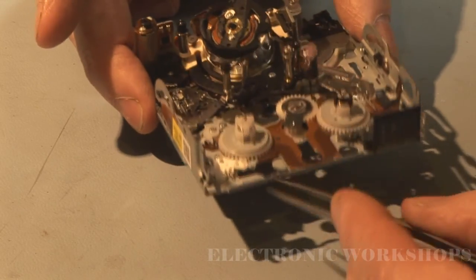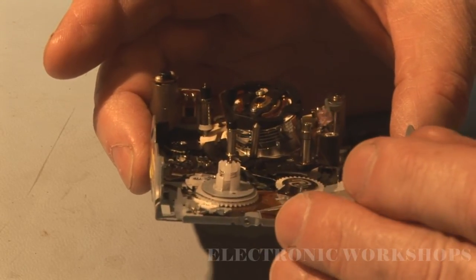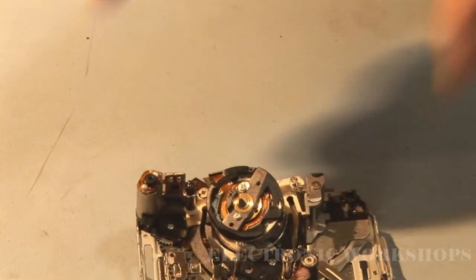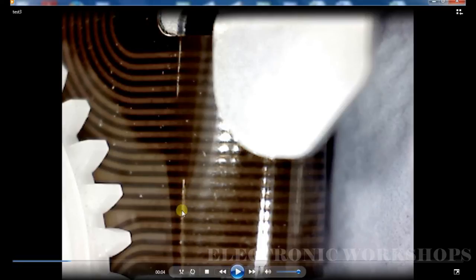Now I'm looking around this end here. Right along that corner there, it looks like there's a bit of a tear in the cable. I've taken this shot with my USB type microscope because it wasn't showing up clearly on the main footage - I couldn't get to zoom in and focus at this depth. We can see clearly at this spot going down that the print is actually broken - missing there along that line. We have the same problem up here even though it's not as clear because it's in a bit of shadow.